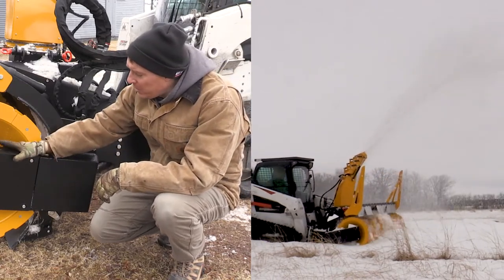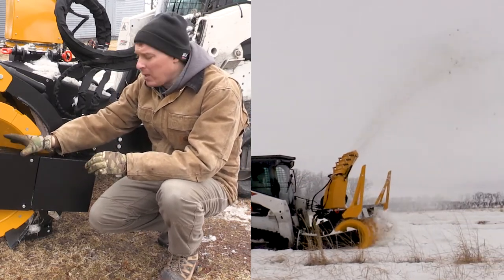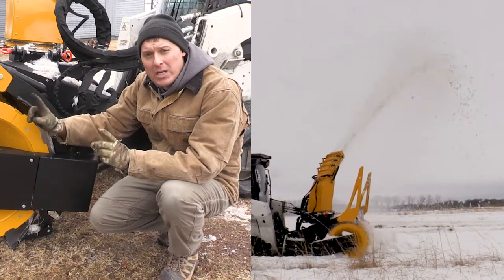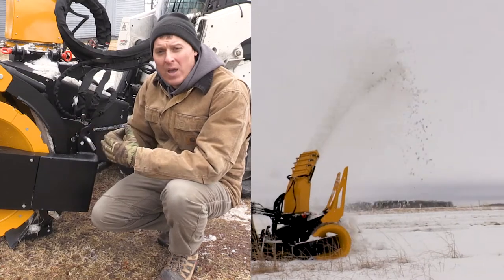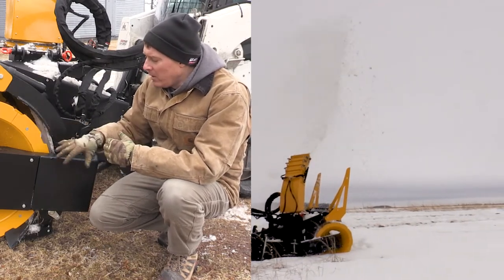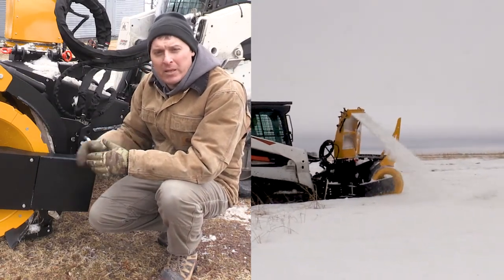The auger is direct drive, but it's a little different from a typical hydraulic snowblower in that it has dual drive auger motors — one on each side — and they work in parallel, splitting the flow. This gives you even torque distribution across the whole auger rather than driving it all from one side, and it keeps things nice and compact. All the hoses are contained and protected inside the arm, so they're not out rubbing in the snow or being damaged.